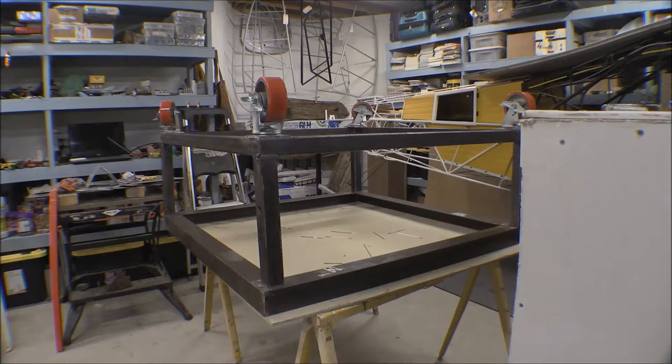I've been making lots of mistakes with the TIG. Right now I've mostly been using the 2T so I can get down in different positions and weld, but the problem is you can't control the current — with the foot pedal you can let off and drop it down, but with 2T you just let off the trigger, let it cool a little bit, and start over. One mistake I keep making is tungsten contamination — I just about wore out one tungsten doing this. Probably the worst mistake is treating this like oxy-acetylene welding: when the puddle starts getting hot and I pull the torch away, you lose your gas protection and wind up burning the weld. At least I know the mistakes I'm making now and I'm correcting for them.